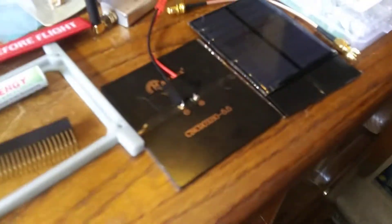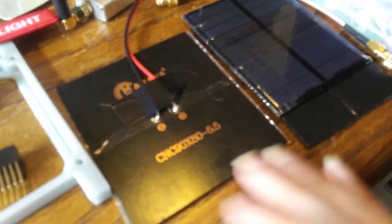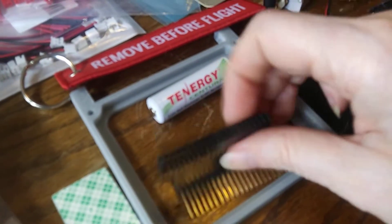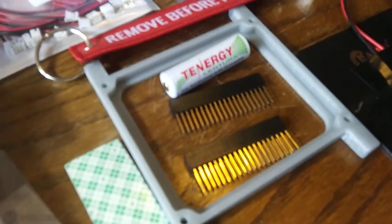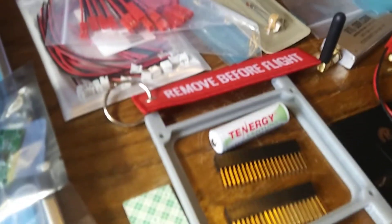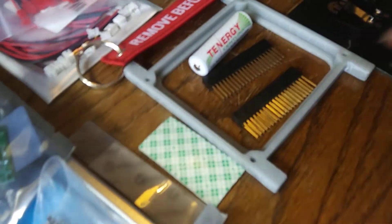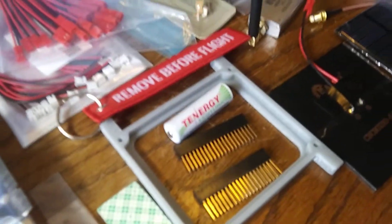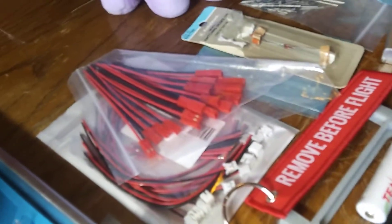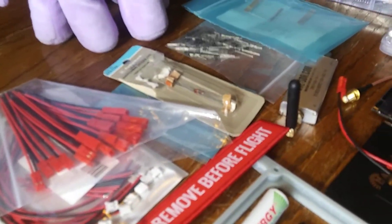Also some other big basic parts are solar panels. These small solar panels — this one already has the connector soldered on to it. There's an example of one of the batteries. These are examples of the stacking headers that you need to stack the printed circuit boards so that the payload board can talk to the Raspberry Pi on the main board. There are also really basic things like velcro and mounting tape. The velcro is for the solar panels so they will stick nicely to the sides of the frame. These connectors are used for the solar panels to connect them to the main board so they can charge the batteries.